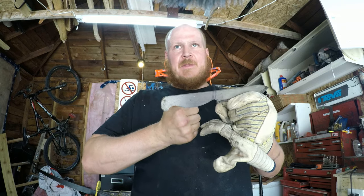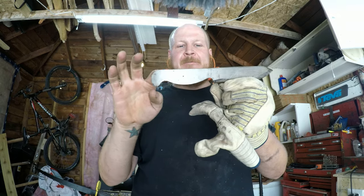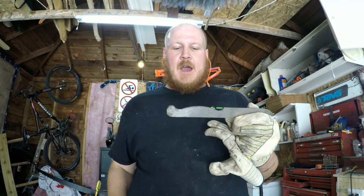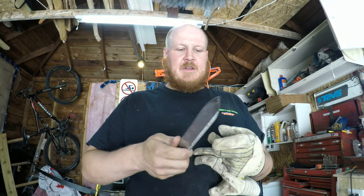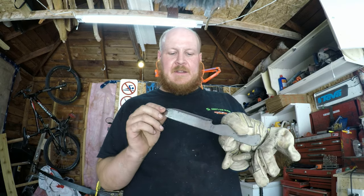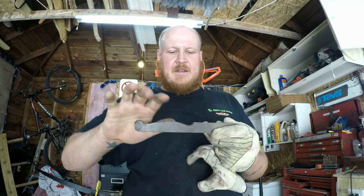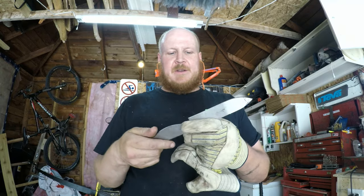With a hidden tang, you just make a little sliver and you insert it inside the wood, and basically your handle gives you strength. Whereas with a full tang, your handle and your knife are all one — so even if you break a scale, you still have a functioning knife. It fits the hand pretty nice, a nice little chopper and cutter. Let's start putting the bevel in. As you can see, I already started because that was an old scrap piece. Right now let's get the starting bevel put in and we'll go from there.